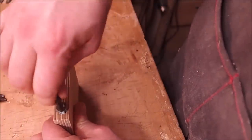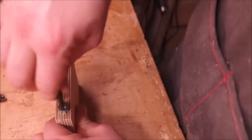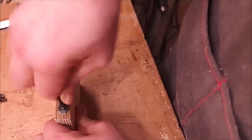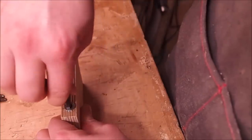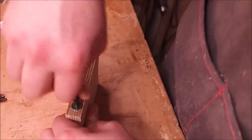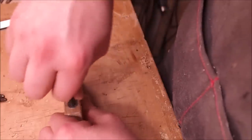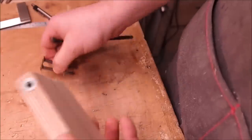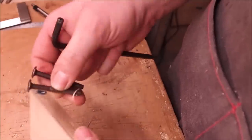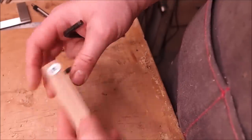One of the things about guitar repair is, as soon as you leave the basics of setup behind, you're constantly building jigs — you're always making something that will help you do a job. You can try your best to make them sort of universal, but at the end of the day, the next job that comes along is going to require something standalone and unique. So it's good to have a set of jig parts kicking around. I use quarter-20 hardware — insert nuts, bolts and such — because you're always building something.